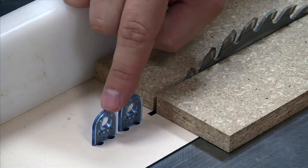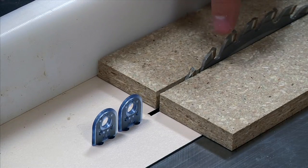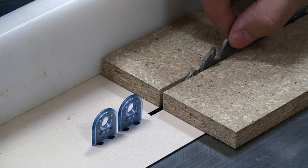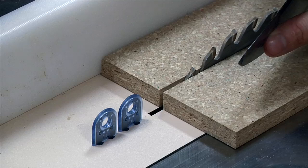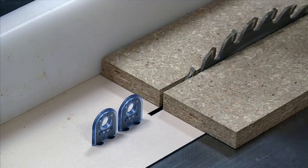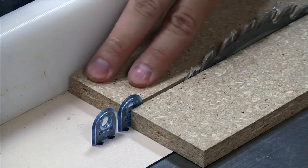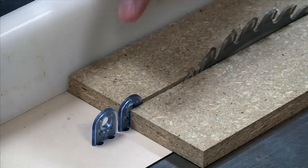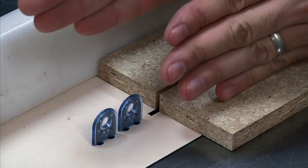When you first look at this setup you might wonder why we would want two splitters in a row. This has to do with blade thicknesses. Different manufacturers have blade thicknesses that are slightly different, so they can't necessarily make these things exactly the same thickness as the blade — in some cases it might be too thick or too thin. When you look at a riving knife or splitter from the manufacturer, typically these will be slightly undersized so you can calibrate it and make it flush with the inside edge of the blade. The problem with that is you still have some kickback risk from your off-cut piece. By putting two splitters one behind the other, they've allowed us to protect ourselves from both pieces because they're slightly offset.